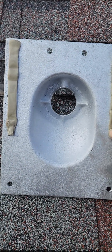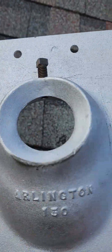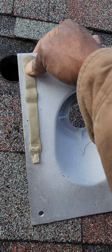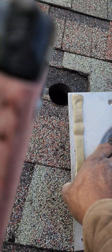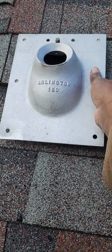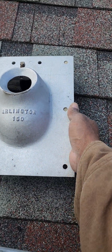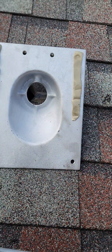I just pressed the strips into the two holes that are here on this back side. You kind of push that through — pushing that putty in just to help seal out the water. This will actually go underneath the shingles here. And then in addition to that, I like to go ahead and put some roofing tar.